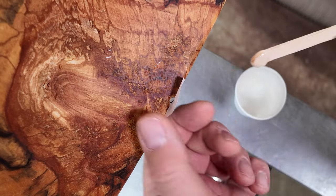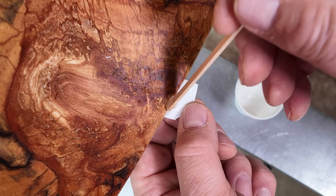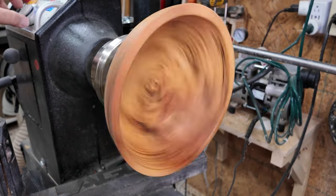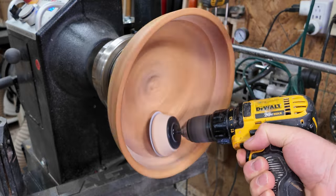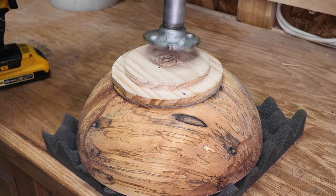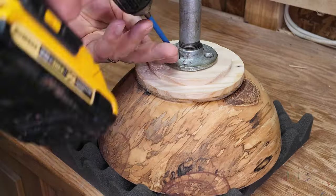Then I left the bowl there overnight for drying with the epoxy, and in the following morning I gave it a 240 grit sand all over. Given that the outside of the bowl and inside have differential spacing, you can see that the bowl wobbles quite a bit, so I can use the drill for the sanding on the inside, and then use a hand piece of sandpaper on the outside. That 240 grit allows the final coat of tabletop epoxy something to adhere to.